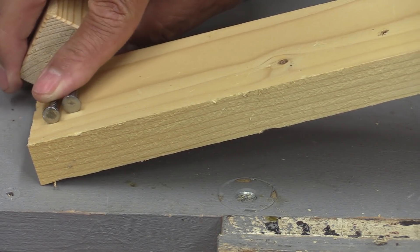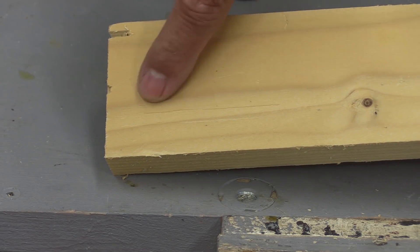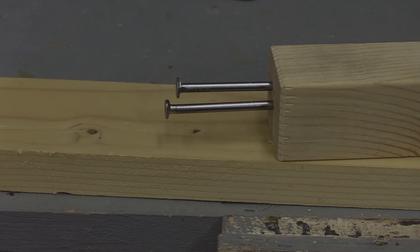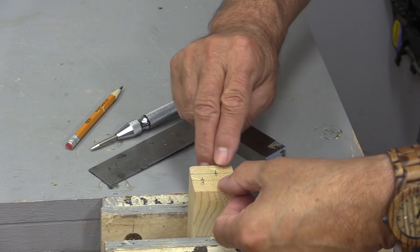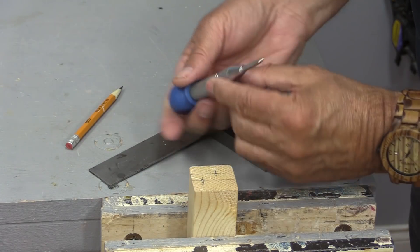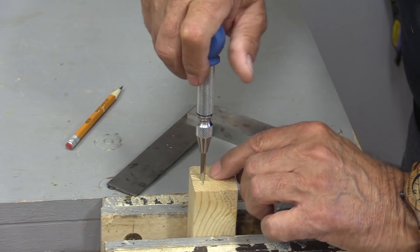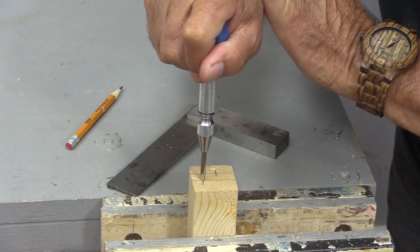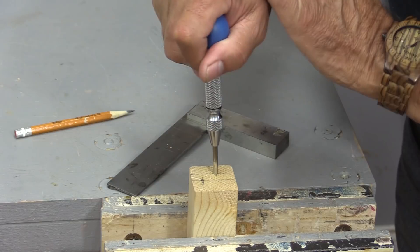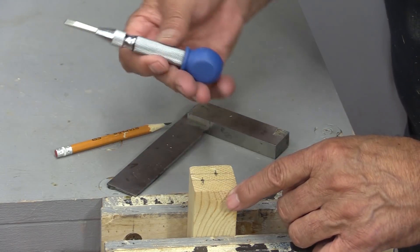Now this is pine, so it tends to wander a bit, but you can see that you can actually make double lines using something like that. Pretty quick and simple, and it's really easy to make the handle. You just set your lines that you want to have your mortise, how far apart. And then I'm using this new little awl tool, a little punch. All you do is set that on the line where you want to drill a hole, and it gives an inset so that you have a place for your drill bit to go into. That way you get nice precision drilling — a handy little tool. I'll put a link in the description for that one.